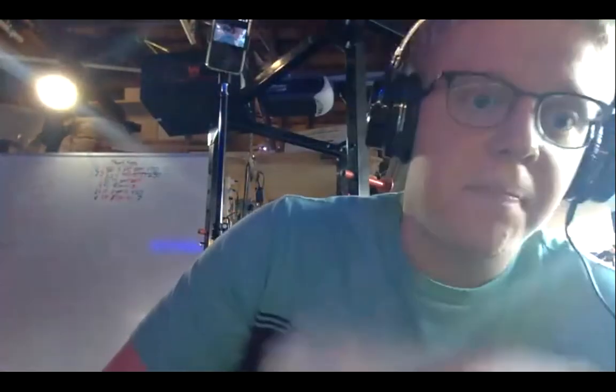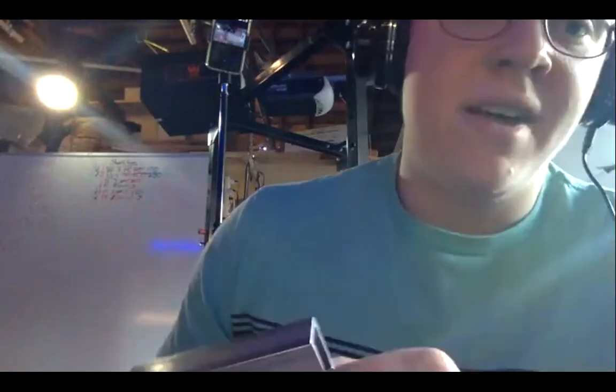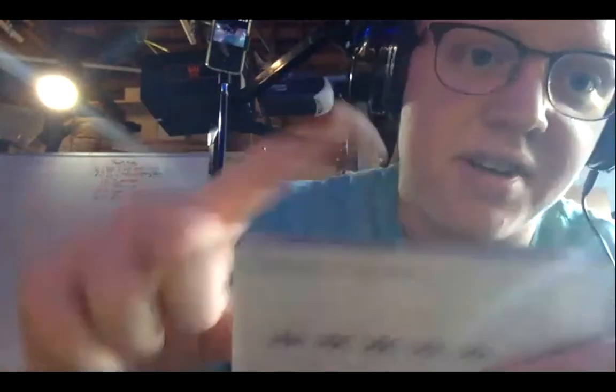Now let's say you want to have a part that has a hole that is 0.463 inches away from this edge and 0.392 inches away from this edge. Well, with a DRO, it's going to be extremely easy to just fine-tune each axis controller until you get to that exact spot, and then get the drill bit at whatever size it needs to be, drill down, and then you have the hole. Extremely accurate, and it'll work perfectly with whatever you need.